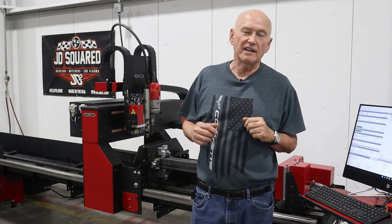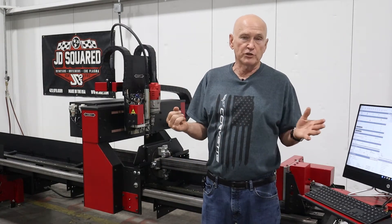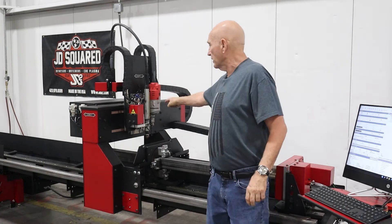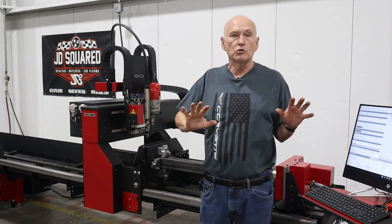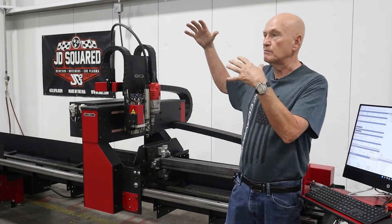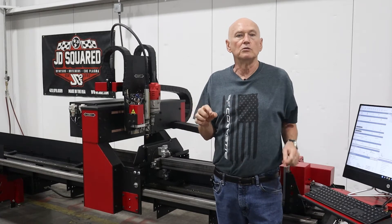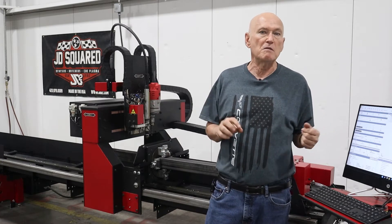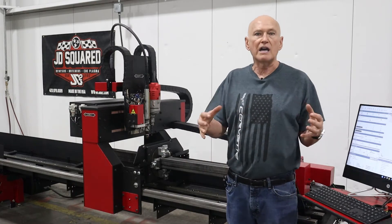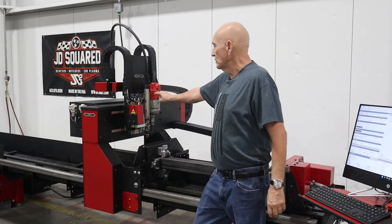So what do you get for your money if you purchase the drill option? You get the drill head — the ones we've chosen are made by Milwaukee. It's a mag drill head, specifically the replacement drill head off those magnetic drills. This particular one has a half-inch chuck, is rated for 200 pounds of downforce, and we're hoping to do half-inch holes. This is shallow hole drilling — not a 15,000-pound CNC mill — estimated at about 12–13 millimeters deep, designed for tube, pipe, channel, and similar non-solid shapes.